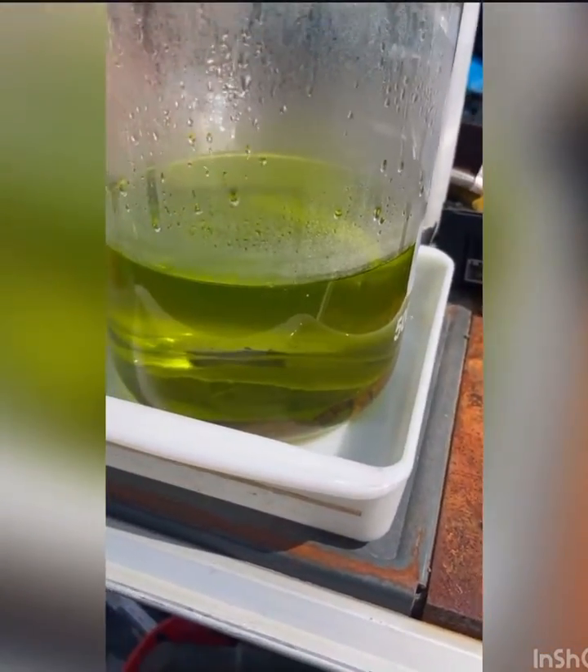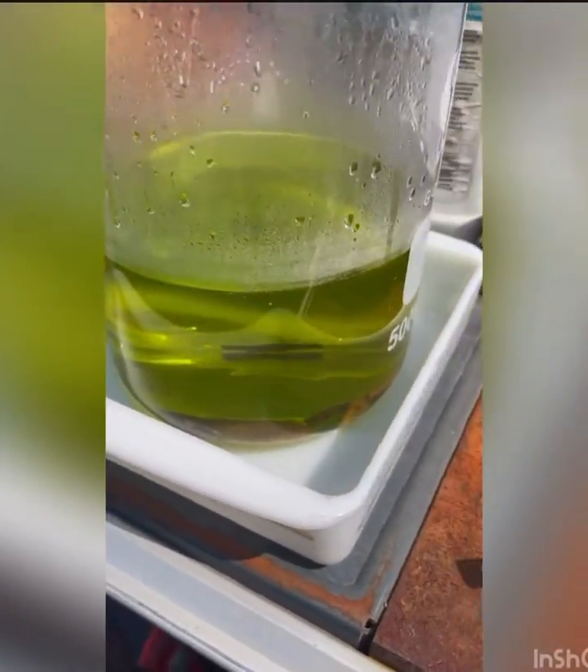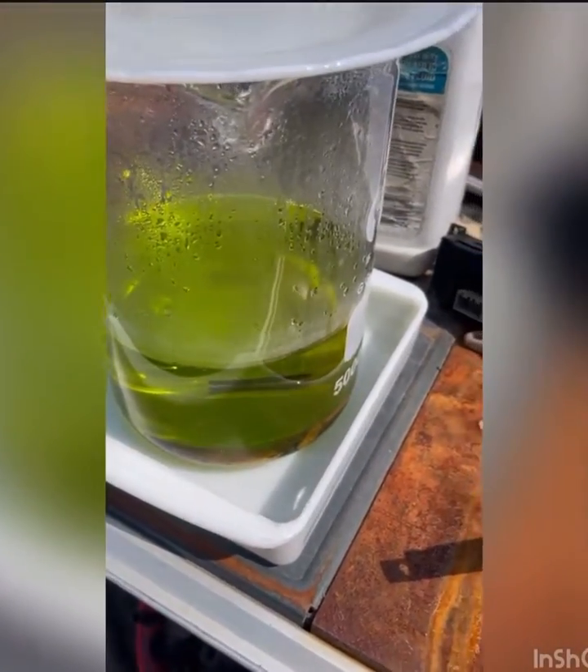I took some hydrochloric acid with a little bit of hydrogen peroxide, about 10-20 milliliters, and added some copper pipe. After burning them, I threw them in there for about three days. Here's the day three result. Now I'm going to pull that copper out and add my gold pins. It should take up to about a week, maybe longer, to pull out the rest of the copper off the gold pins. When it's hard to get the acids you need, you have to make some substitutions — this is some poor man's nitric.